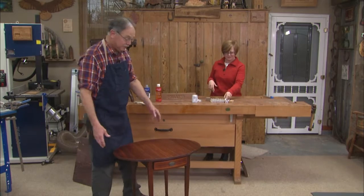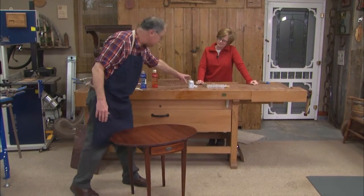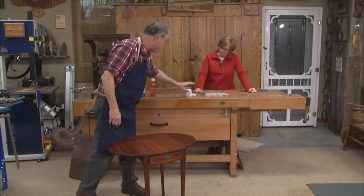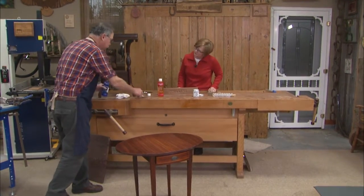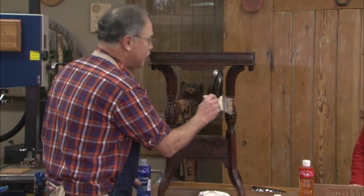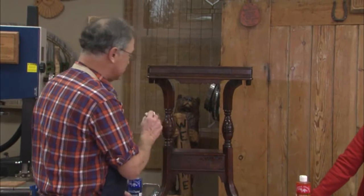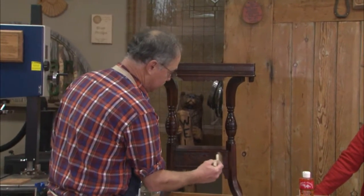They do work. Now, this project is ready to cure for a couple of days, and then it gets top coated with a really good wax, in this case, Renaissance wax. Can't beat it. Now, on pieces like this, save the finish. I just use a furniture cleaner, soak it into the brush, get it in there thoroughly. And you know, it's really the cooking oil that floats around through your house. It settles on your furniture over the years. It dulls down that finish.